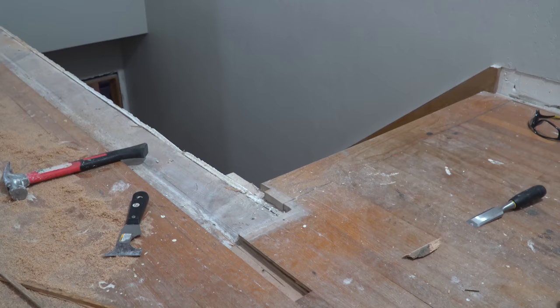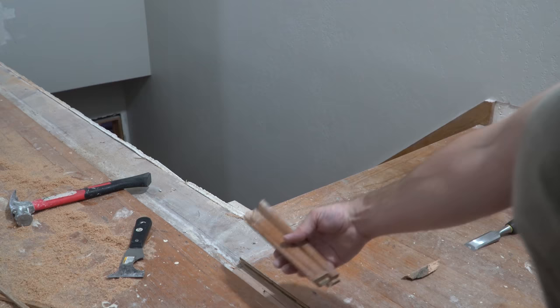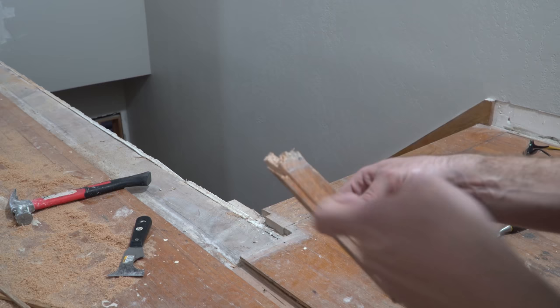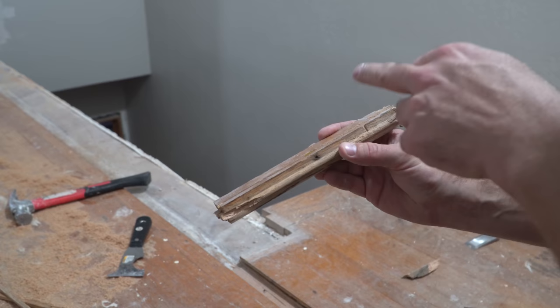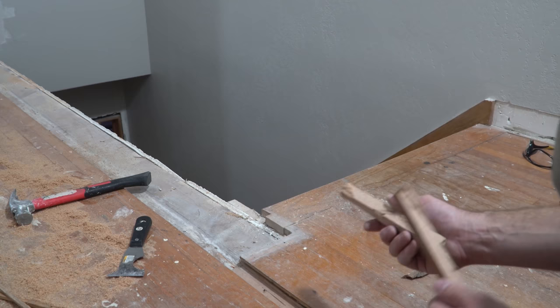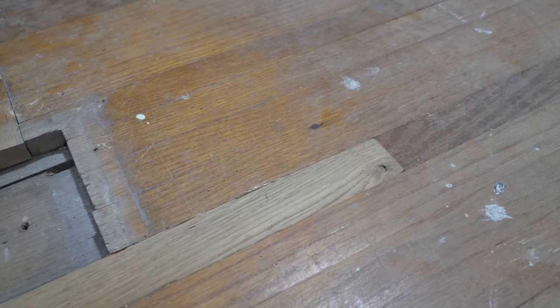I cut out all the way to the end of a piece so I can stagger these and they don't look like I just dropped them all right in place. I managed to save the tongue and the groove on both sides, so we're in good shape. I cut thinking there was another nail in the middle — there was no nail in the middle. All the nails were coming in from the tongue side. I said before I thought they would come in from the groove, but clearly they put it in on the tongue side because I cut right through one. Didn't even notice — must have a combination blade in there — cut the nail and the whole thing just came right out.